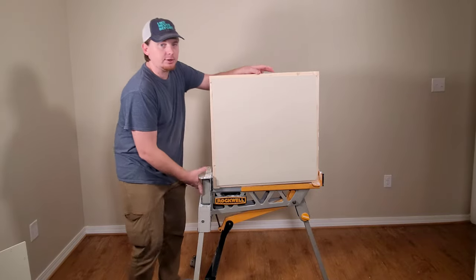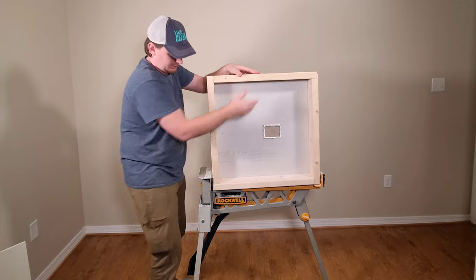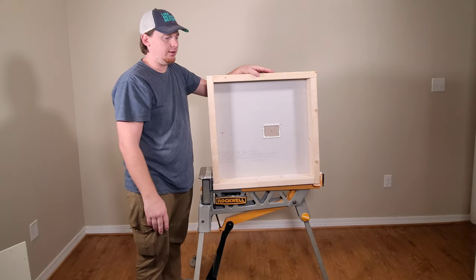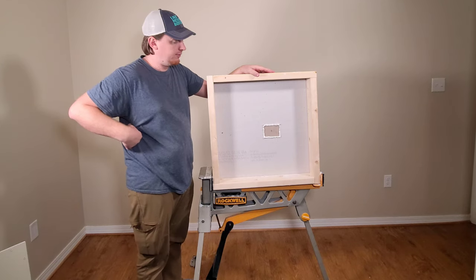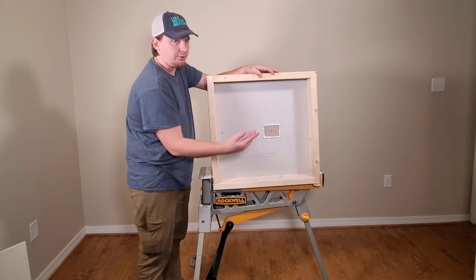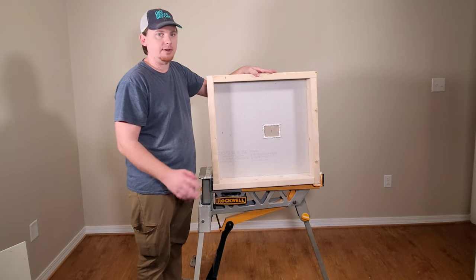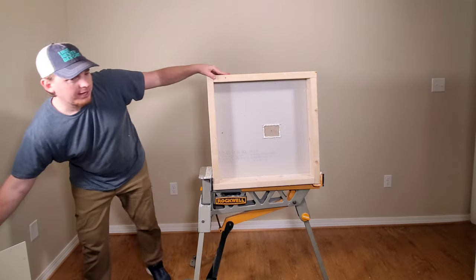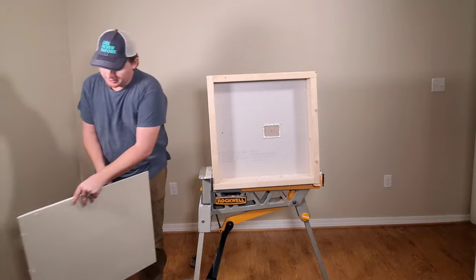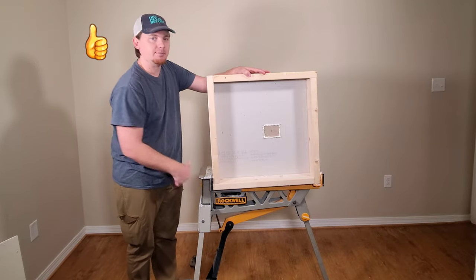Here we are with the final results — it looks pretty good. I used five-minute mud, but if you've not worked with drywall before definitely don't use five-minute mud. If you're using a fast-setting compound, use at least a 20-minute mud, if not the 45-minute — the number refers to how long you have to work with it. I used the bag method; if you're interested in that check out my other no-float drywall repair video. If you were going to do a bigger patch than this, consider putting a board across the back for stability. If you found this video helpful, please hit the like button and subscribe for more.